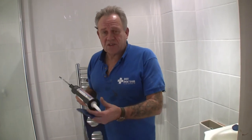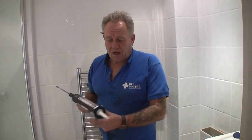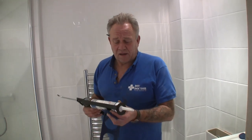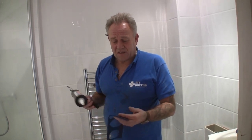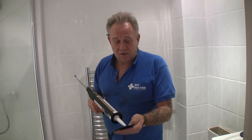Cut the bottom piece first. Use a cardboard template if you need to — we've done it before so we've got a rough idea of the size. Give yourself plenty of room because a bigger hole can be made smaller by putting little pieces of mat in afterwards, so don't underdo it. Then to stick it down to the base of the cistern we're going to use EverBuild Forever White — it's an excellent bathroom mastic. We're using this on the bathroom anyway, so there's no point buying another tube of sealant just for this.